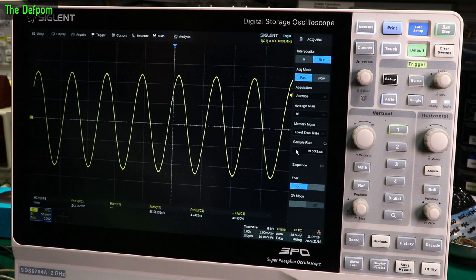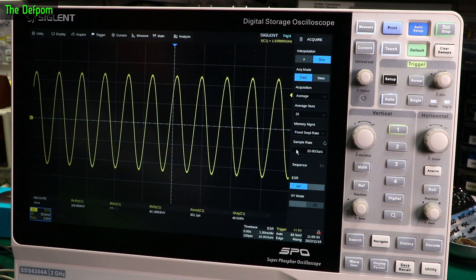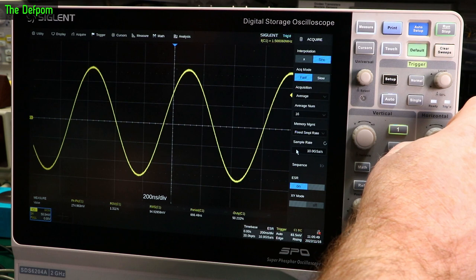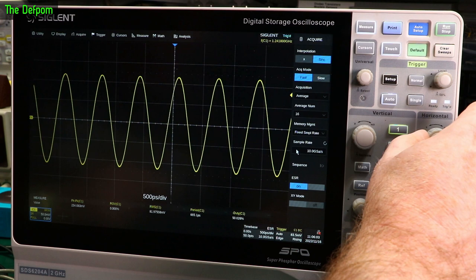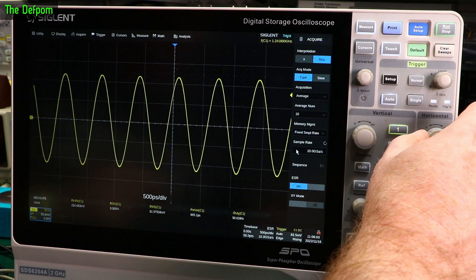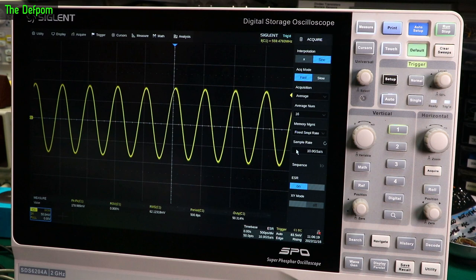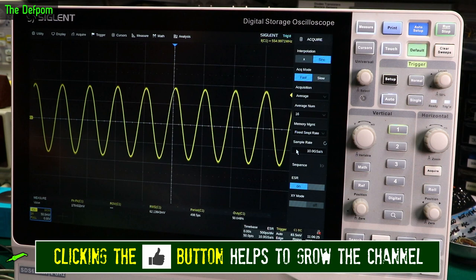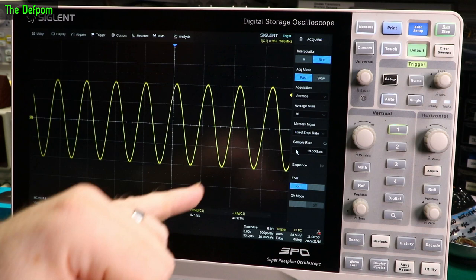At 1GHz: 81mV — no problem. All that noise has disappeared. At 1.2GHz: sitting at 84, looking fine. At 1.5GHz: 81mV. At 1.8GHz: down to 75 millivolts. At 2GHz: down to 62 millivolts. Now don't forget we're using a BNC cable — even moving it around might change things slightly. At 1.9GHz: 70mV. So 1.9GHz is where I'm getting the 3dB point. My setup isn't ideal, so it wouldn't surprise me at all if that's causing the slight difference between the 2GHz spec and what I'm able to produce. We're seeing RMS around 71mV. So we're doing 2GHz basically, and it is just about meeting the spec — barely — with my not-ideal test setup.